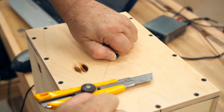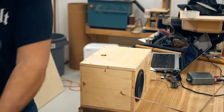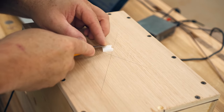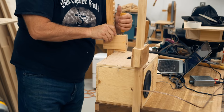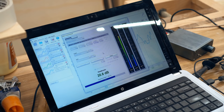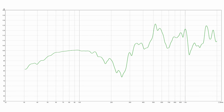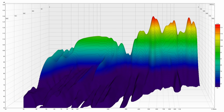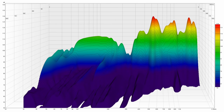For maximum stability, I clamp the box down to my very heavy workbench to keep it from moving around. The next panel I'm testing is the oak veneer plywood. The accelerometer I'm using to measure the vibrations is fastened to the center of the panel with very thin, very strong double-sided tape. Here are the results for that panel, plus the average of the four measurements. Here's the average from the Baltic birch overlaid in orange to compare. Looking at the waterfall, we can see there's a little bit more energy down low, but it doesn't hang around very long.